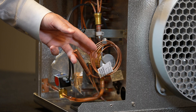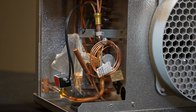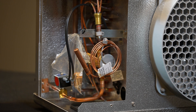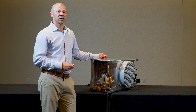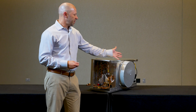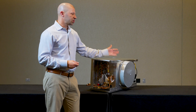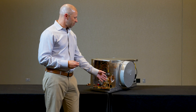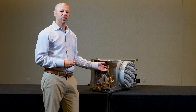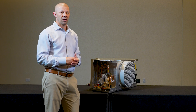The purpose of an expansion valve is to adjust the mass flow to the evaporator as the heat load adjusts in the room. The function of an evaporator itself is to actually absorb all the heat we're trying to remove from our refrigerated space. The fan circulates the air in the room, which is exposing the coil to our heat load. The valve here is adjusting the amount of refrigerant feeding that coil based on how the load fluctuates.